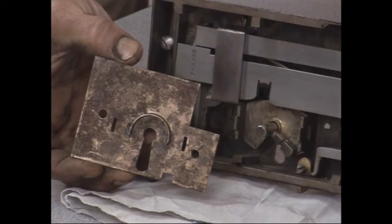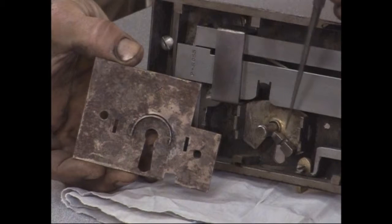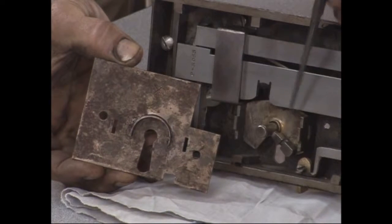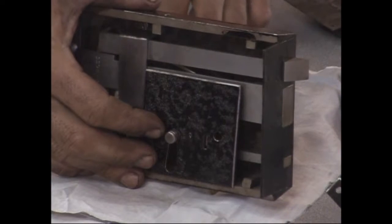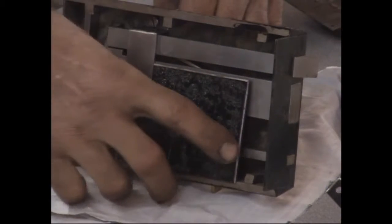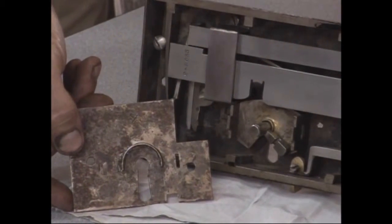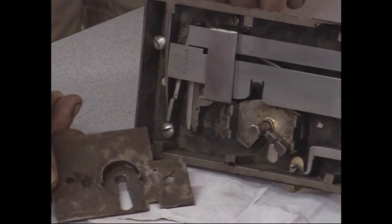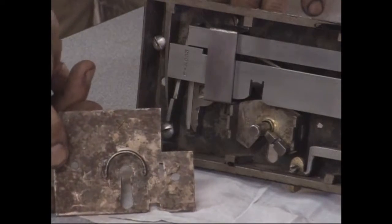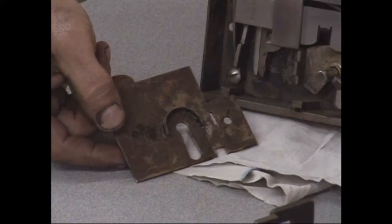So that second cutout, and we call those wards, the obstruction and the slot are both called wards. The key has to have both of those wards in order to pass the wards in the lock. And you could have multiple wards then? Oh yeah. I have two already. But you could have six. You could have additional rings if you wanted. Exactly. So that is the security system in an English door lock, is ward.